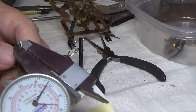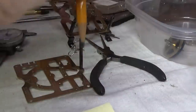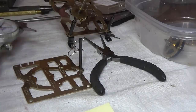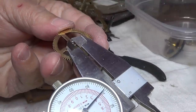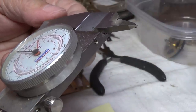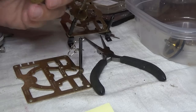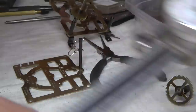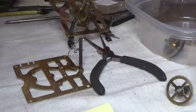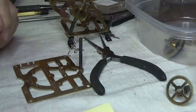Holy mackerel, it's a pretty thick one. It looks like about 1.7. So the front is 1.7. Front 1.7 millimeters. And the back pivot. Bushing size. We need to look for the reamer size, then a cutting broach size, and a smoothing broach size.